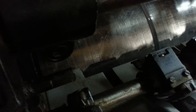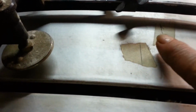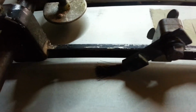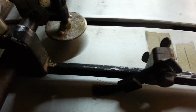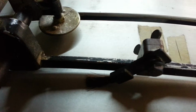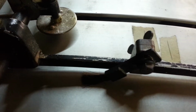Because that plate could be out of adjustment and actually lower than the swing arm grippers coming to pick it up. It'll bang into it, and that's where it looks like it's bouncing, and the drop guides will come back up and push the sheet back past the point it's supposed to be. These brushes here are not going to keep it from doing that. They just keep it from jiggling a little bit. But if the transfer grippers come back to pick the sheet up from the feed board and they're a little higher, it'll push that sheet back and there's nothing you can do to stop it.